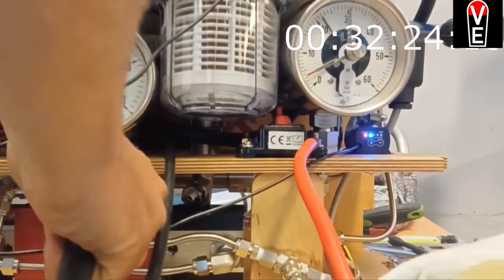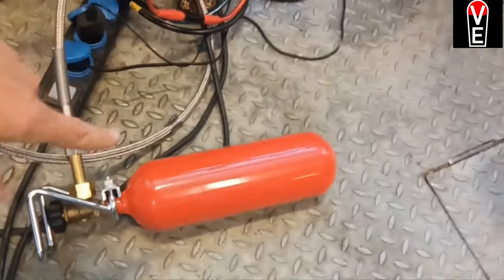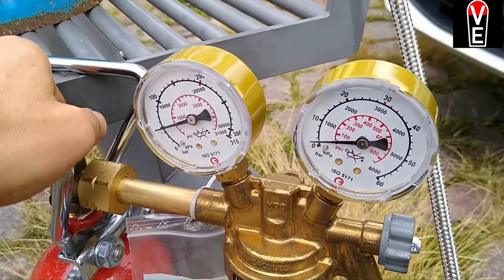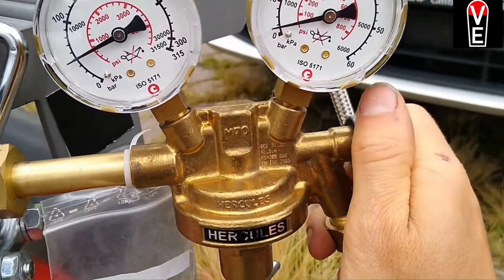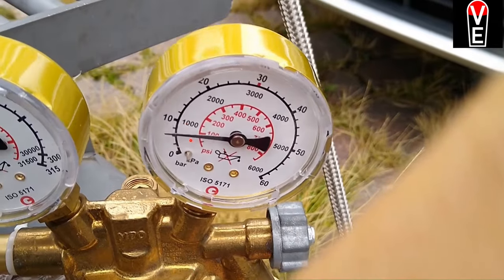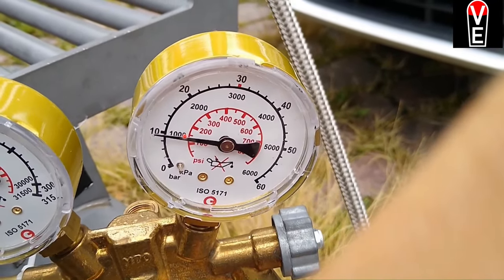Then compress this few minutes' worth of excess solar energy and you have 120 liters of hydrogen. It goes via this cable into this bottle. And this bottle is actually what we see here, just with a pressure regulator. I open this valve before I really tighten the end of the tube, because I want the hydrogen to evaporate. This is the set screw. I can set the secondary pressure, and I do it up to 10 bars.